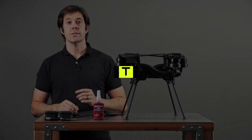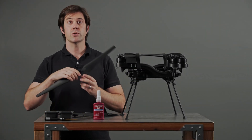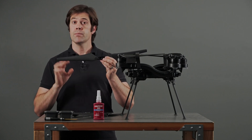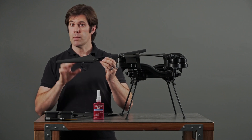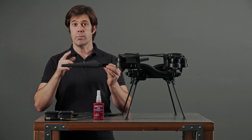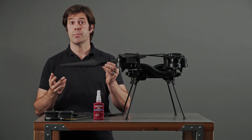In this video, I'll show you how to replace Astral propellers. The first thing to know is that the propellers should be replaced as an assembly — the whole thing together. The reason for that is that these blades are a matched pair. They're balanced. So if you replace just one, your Astral will vibrate because the weights will be slightly different. So replace them together as a pair.